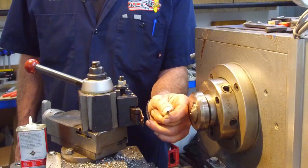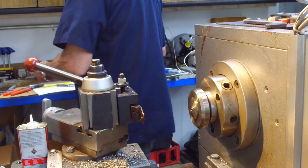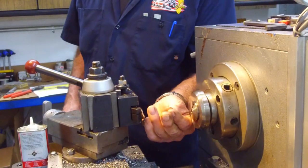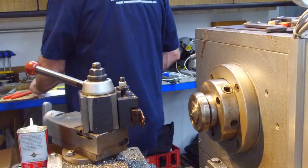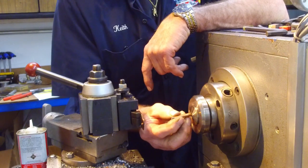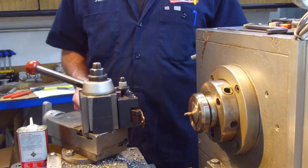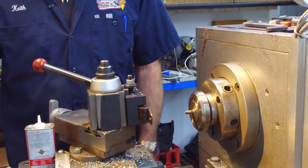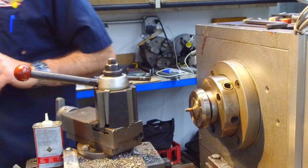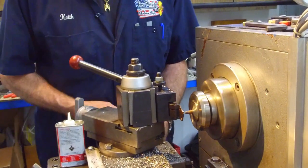Okay, that's the size of the little ferrules that we're making. And actually, here's one that doesn't have a line through it. It's quarter inch, and it's only 150 long. We're making these out of old contact tips, and we saved the old contact tips, and these happen to be quarter inch on the diameter. They're copper, so they work really nice for a ferrule. All right, first, we're just going to trim it off at the end here.